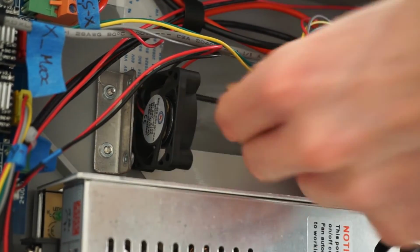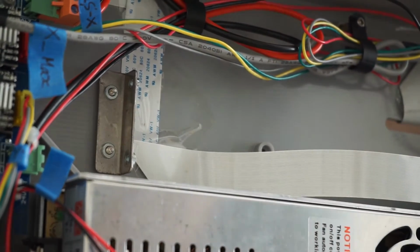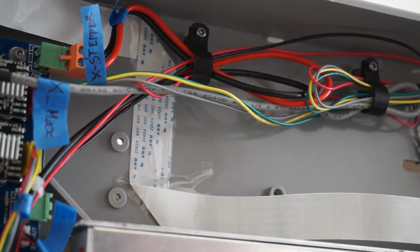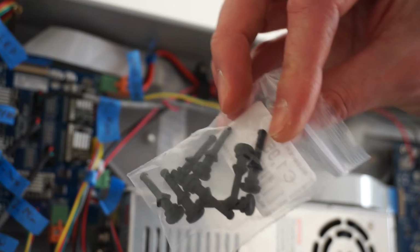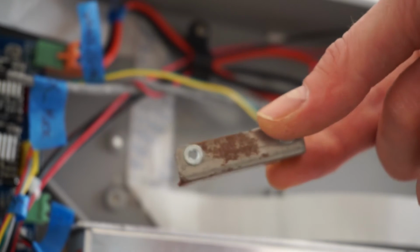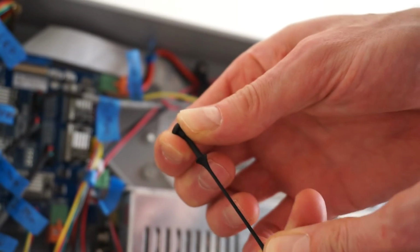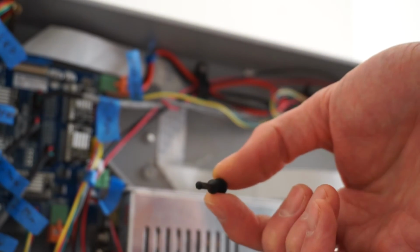It is directly mounted to the plastic chassis of the printer, allowing the vibrations generated by the fan to be transferred directly into the bottom and side panels of the enclosure. I decided to try some rubber fan mounts to reduce the noise caused by the vibrations of the chassis. Another issue is that only two mounting points are used, causing additional vibration due to the flexing of the fan body. It has to be said that even when you disconnect the fan completely from the printer, it still makes quite some noise, but it sounds far less intrusive than when it's mounted to the chassis.